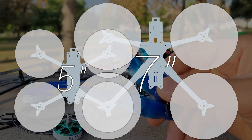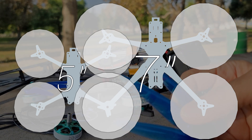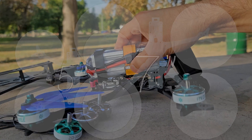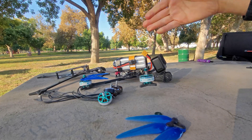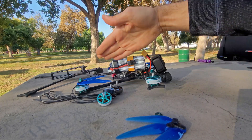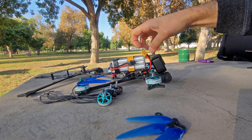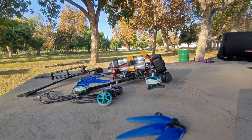With a 7-inch prop, you do get a lot more surface area — as in prop disc area — than on a 5-inch quad, so it's not going to affect it as much, but it still affects it quite a bit. This quad, without the GoPro on board, flies like a different quad entirely — it flies so much better. But if you're flying something like this, you're probably going to want a GoPro on board, and that's primarily why the overall frame design has this kind of big dead cat style. It's become very common to build this sort of setup with the battery on top and a bus setup with the camera up front, and having the camera in line with the battery provides better concentration of weight in the middle of the frame, so that you get better control over the quad.